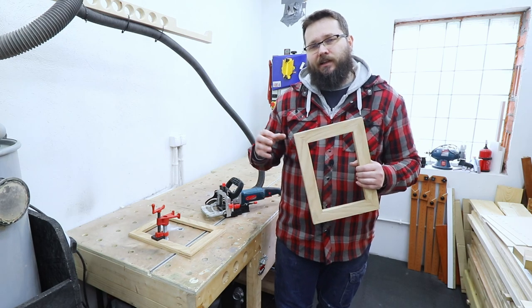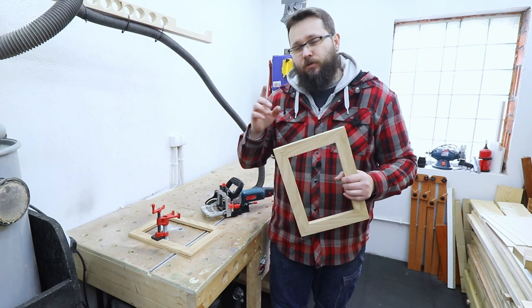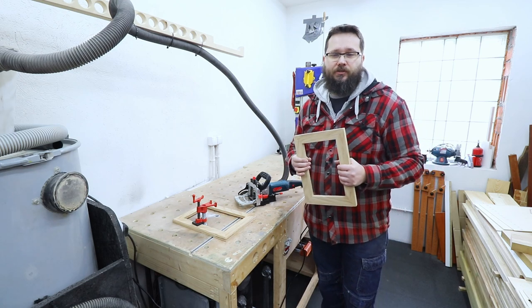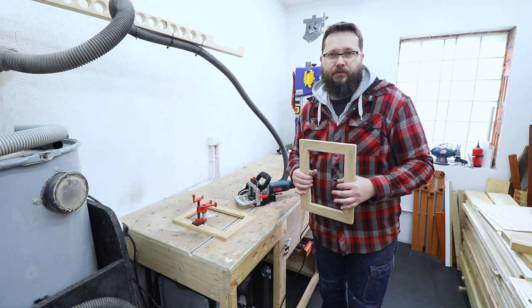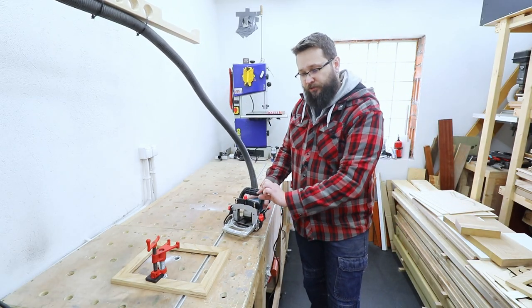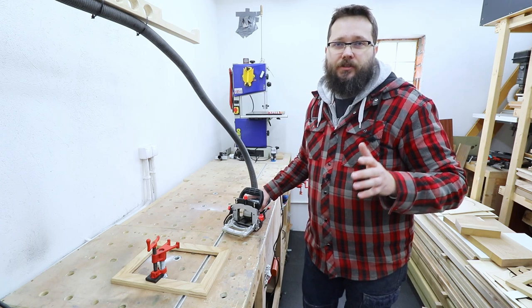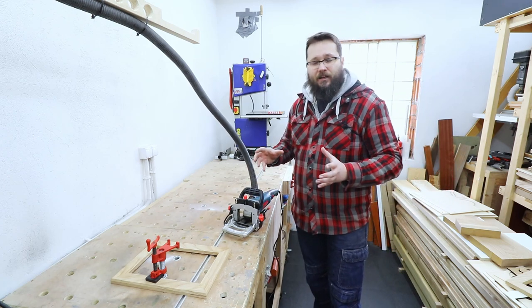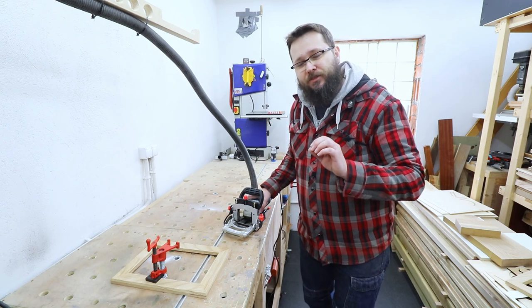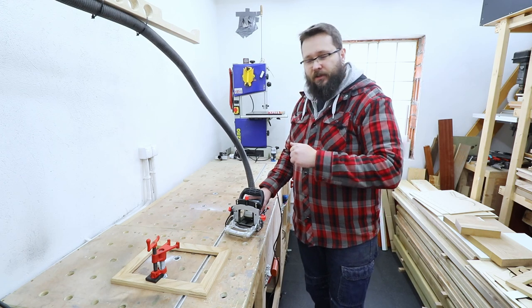However, reinforcing the mitre joints can actually add a visual effect as well, which I'm going to show you in today's video. Now I'm going to show you four options that I tend to use when putting together my picture frames. So the first option: a biscuit joint. It will allow you to create a slot in the picture frame itself on the corner and we're going to be able to install a spline. That will actually add an additional benefit to the picture frame as it will look nice, especially when you add a contrasting color spline.